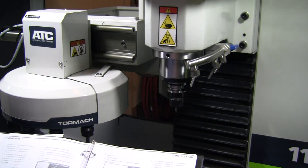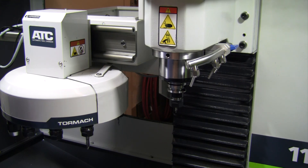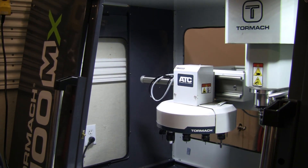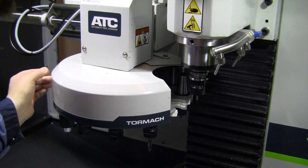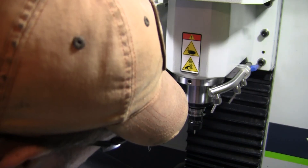I've got my manual out reading the instructions on how to adjust the tool tray alignment, set the tool tray height, and the encoder position — that's on page 63. First, with a tool in the spindle, go to the ATC tab in Path Pilot and select 'Reference Tool Tray.' That caused the tool tray to spin and do all kinds of things. I used 'Tray Forward' to get it back to my open space, then rotated it a couple of times to reset it, turned the air off, slid the tray forward, and jogged down — I definitely needed to go counterclockwise, which is minus.